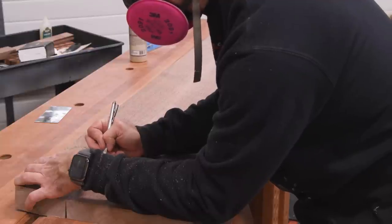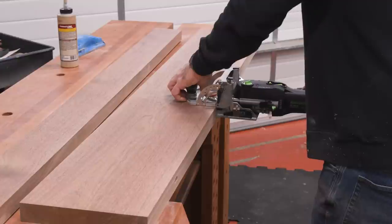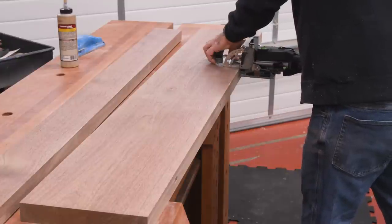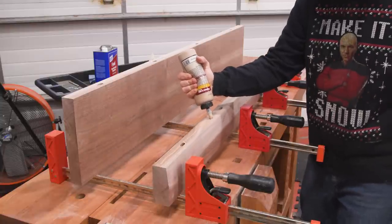The two parts are glued up, and in order for this to work, the thinner part of the tapered section should meet perfectly with the back of the flat section. Otherwise there's going to be a ridge there and it's going to be real hard to remove after the glue-up. That's actually why I'm using dominoes here, just to keep everything nice and aligned.